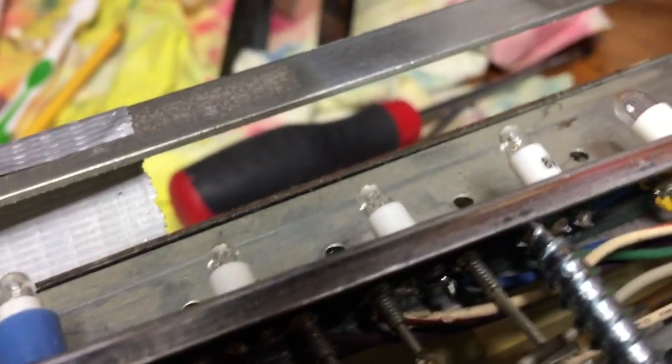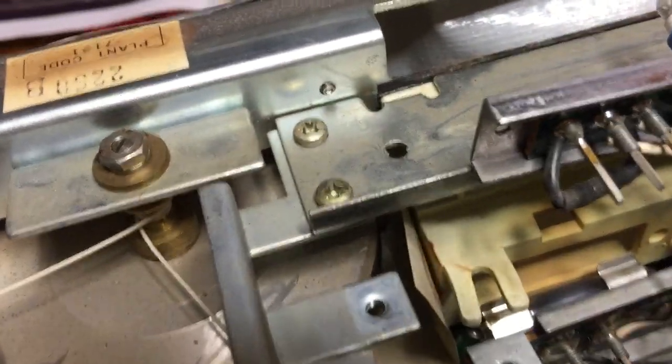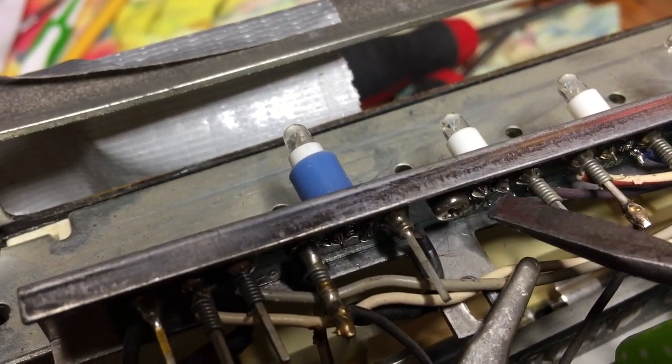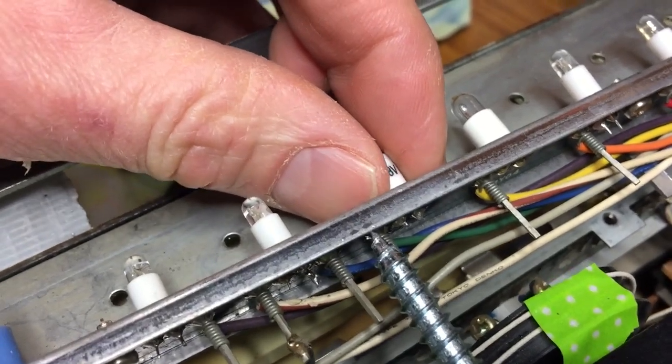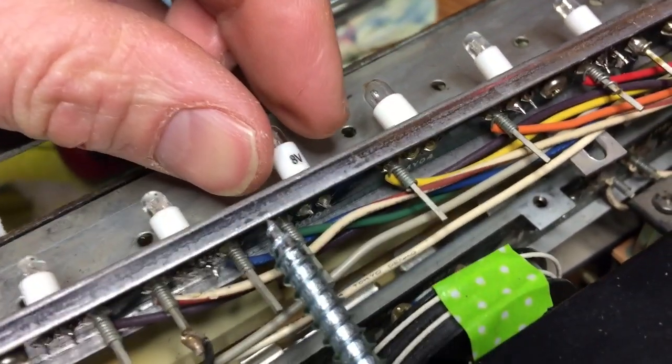You just have to heat it to pop out the old ones. God, getting this frickin'... You just have to pull, put your soldering iron, and just go between the two poles and just keep tugging a little bit, just gently. Tug one side at a time, back and forth, back and forth. It takes about 3 tries. The old one will pop out.